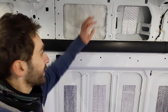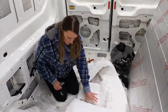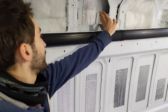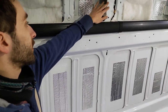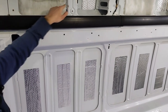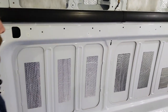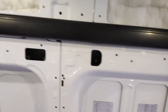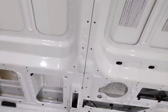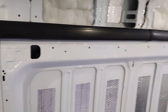The insulation is starting to go in and it's looking really nice and fluffy, which is great. It also creates a nice knee pad for me. Each cavity is a slightly different size and the braces for the inner frame go inwards. What we're doing is measuring to that part and then just stuffing it in so we have a bit extra. We're doing the top and bottom and then that's pretty much one side done, then the same again for the other roll on the other side.